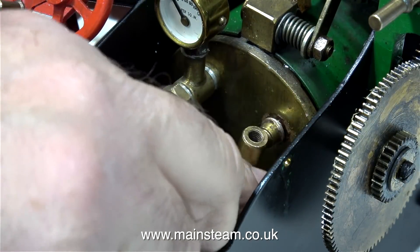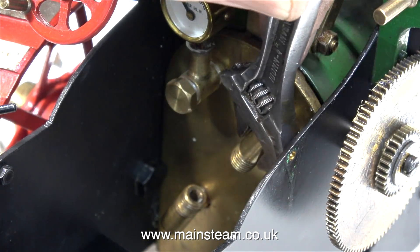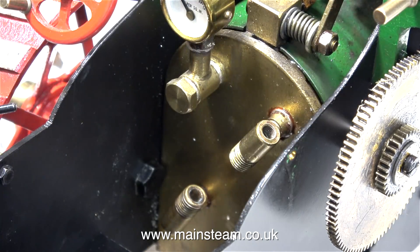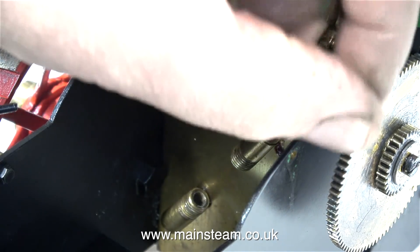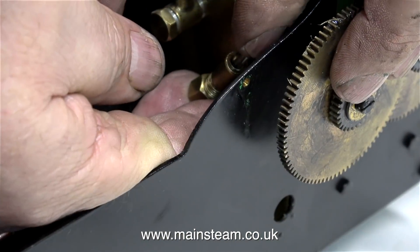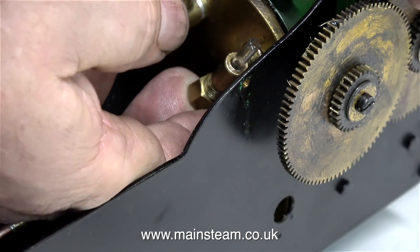This job was very fiddly — I don't often work with things quite as small as this, and sometimes I wish my hands were very small and delicate so I could get them into much smaller spaces. With both the fittings in position, the glass is very tight. I'm not happy with how tight this glass is. The glass is 4mm in diameter, so I enlarged the holes in both the top and bottom fitting to just give it a bit of clearance.